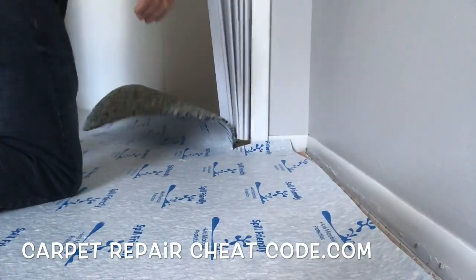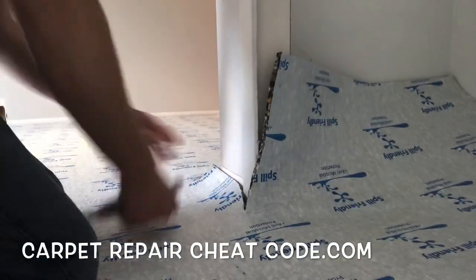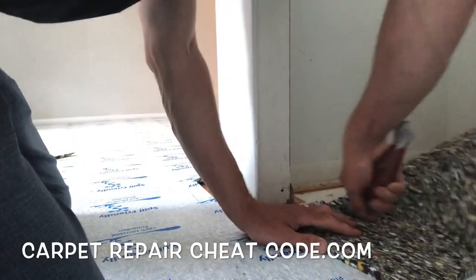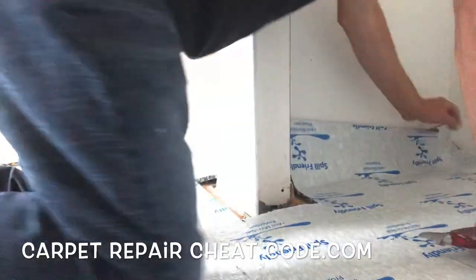Be careful when cutting. If you're new to this or a DIY type, use a utility blade — they dull out fast but you're less likely to lob off your fingertips. Carpet knives are ruthless; it only takes a quick second to chop those up, and we do not want that. Go ahead and rough cut everything in, then start tracing the tack strip.